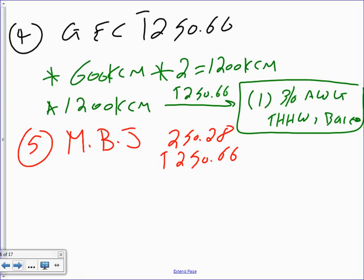When the lug does not match the cable, and you're trying to force that sucker under that little lug? Give it a haircut. Just give it a haircut. Is that what you call it? Haircut. Now that's not cool, though. You basically, here's a conductor that's 4-aught. Now you made it 1-aught. Yeah, thank you. You stuck it under the lug, but it becomes 1-aught because you gave it a haircut.